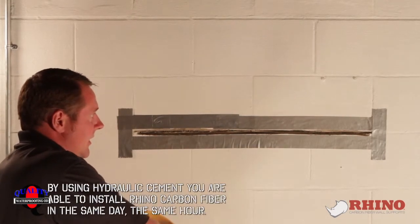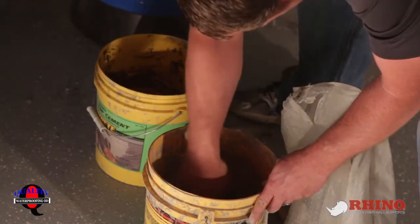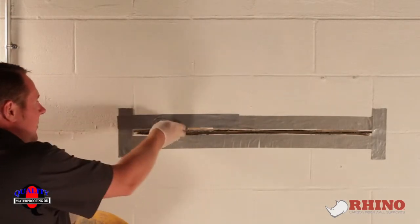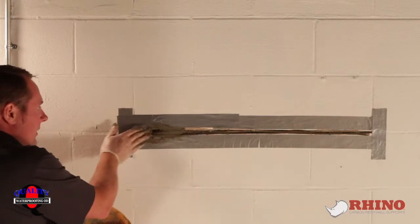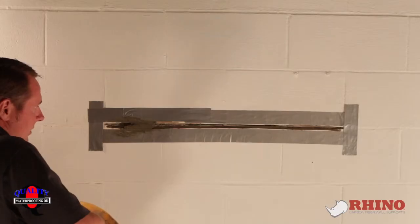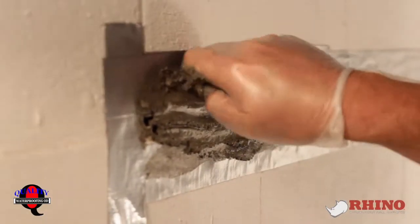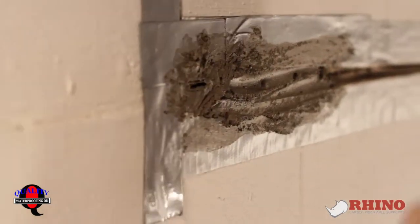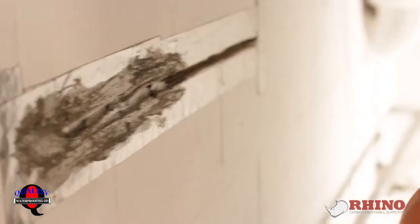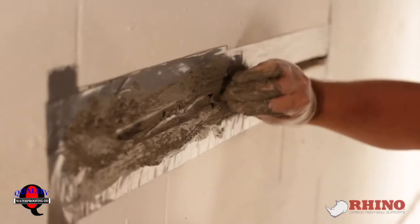Here we've got our crack taped off. I mixed up a little bit of hydraulic cement — you can use mortar, but hydraulic cement, if you're getting ready to put carbon fiber over it, is a little bit better. It sets up a little bit quicker. I mix it a little bit wet, and doing it this way I can literally put rubber gloves on and put it in with my hands. If you did this normally it would look horrible, but because I took the time to tape off the crack, I can smear it on the wall — it's no big deal, it will still look professional. When I tell contractors to just do it this way, they think I'm crazy — they think you need to go buy all the tuck point tools and spend a whole bunch of time and money. Here you can just do this nice and easy, and if you use hydraulic cement you can literally get your carbon fiber up 15 minutes from now.